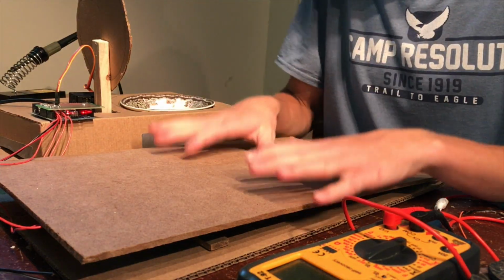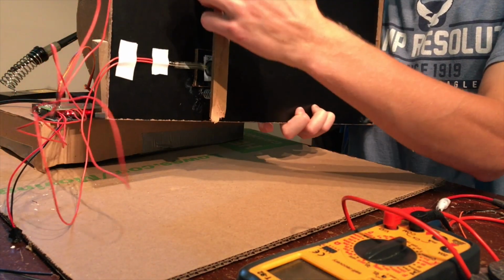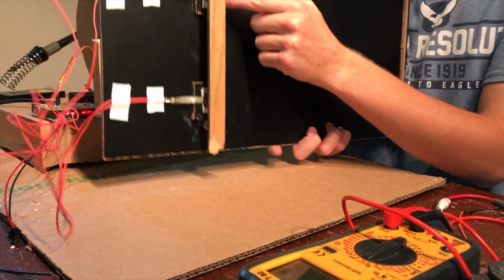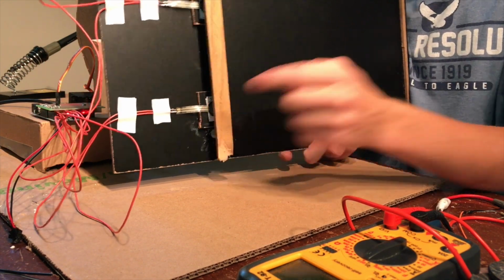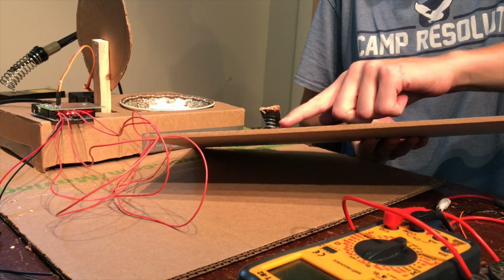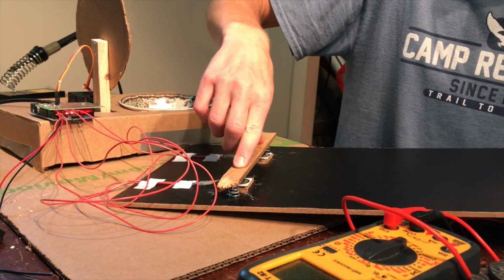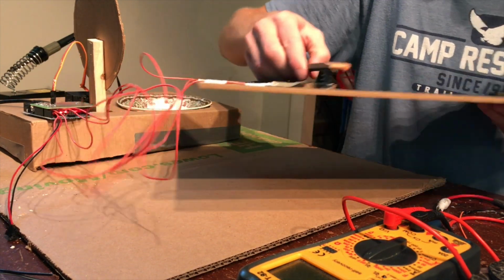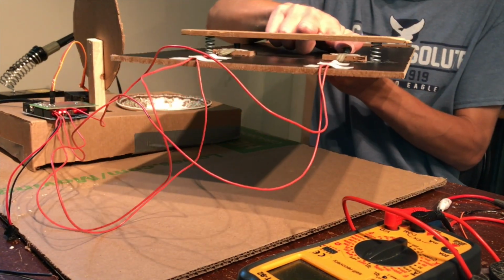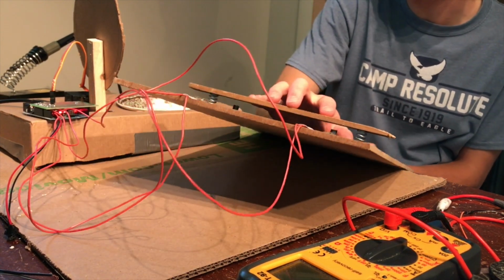Okay, so to start with, here's the scale. The scale has 2 pressure sensors, one right here and one down here. It's also got this board sitting on springs right here. So when I press down on the board, at first it doesn't touch the little pressure sensor feet right here, so the pressure sensors don't feel anything at all.